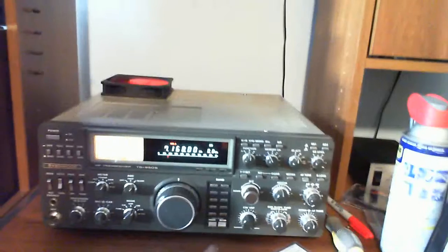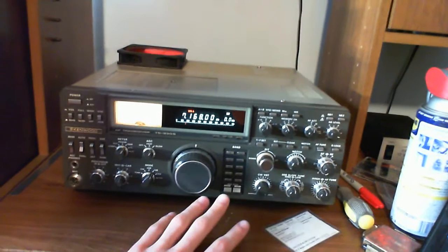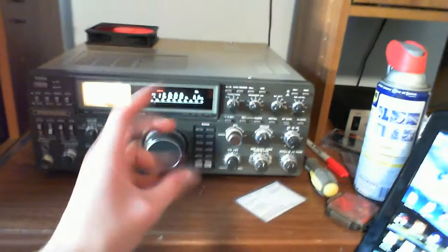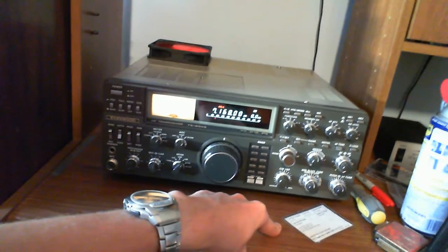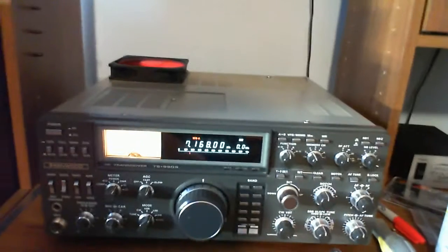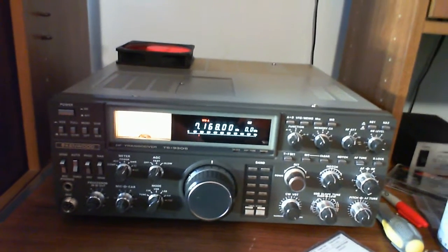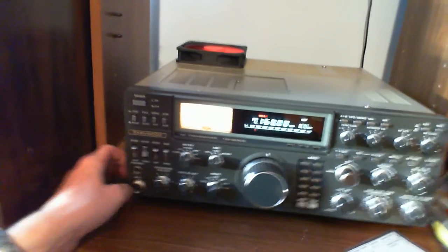Touch lamps, those little lamps that you touch and turn on, go nuts, and I don't think you can fix that with chokes, because they actually work off of RF. The body of it is almost an antenna, and when you touch it, it's like adding length to the antenna, and the resonant frequency of the body changes, and then it senses that with a little chip and turns on the lights. So if you're putting a lot of RF into it, I don't think you can really do anything about it. By design, it's meant to be an antenna. So, can't fix that. But I have some audio problems with the receiver downstairs, the one hooked up to the TV.